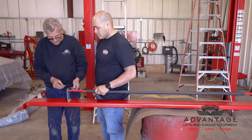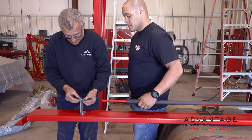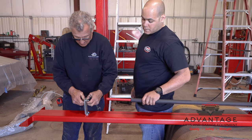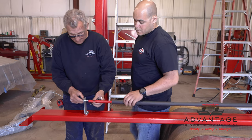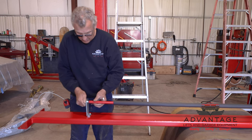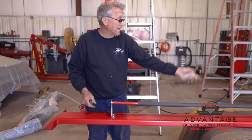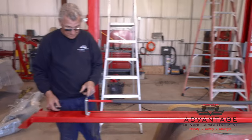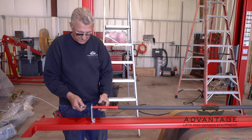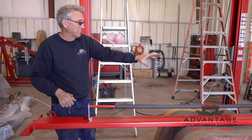Okay, now because this has to float, we put a bolt through and then we have a jam nut. It needs to rock. Turn this in, then actually take the jam nut, jam it against the rod. Now, go ahead and work it. If we were just to tighten this tight against there and put it against here, it may take more effort. It could possibly bend the rod. So that's why you get the jam nut and the nut, to allow yourself a little play at this end for it to pivot.